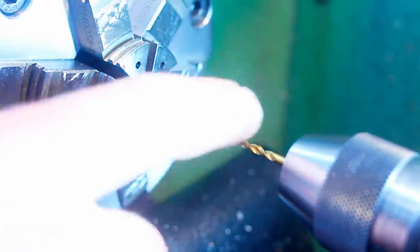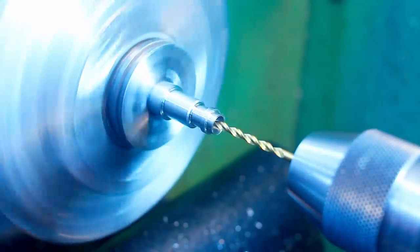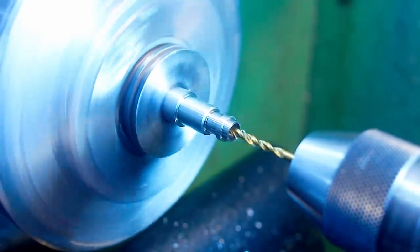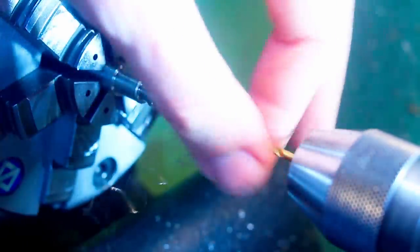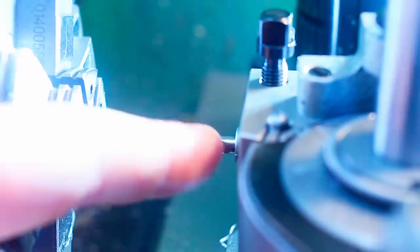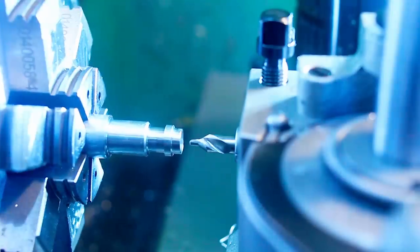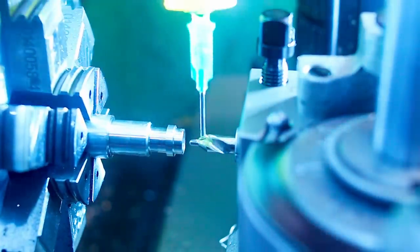2.6 millimeter drill bit. This is to open up the 2 millimeters through hole to final dimension and leaving a good finish. Running at 1000 RPM. And now for the last tool, a center drill. I'm holding this in a split collar in a regular tool holder because for this application I want a very stiff tool. I'm dropping the tool in until the angle of the 60 degree cone hits the through hole, like this. I will hit it there, zero out the DRO, and then I will cut with the center drill to my final depth.